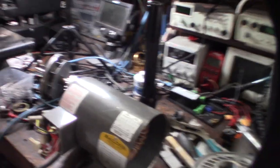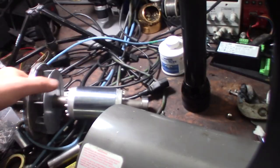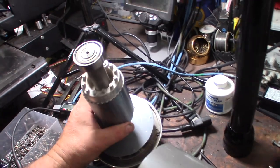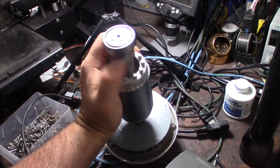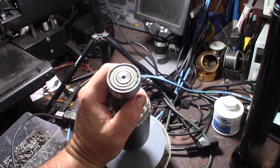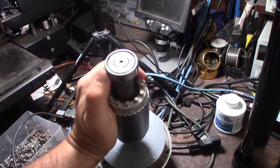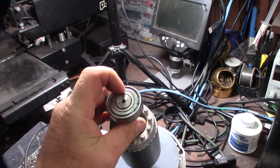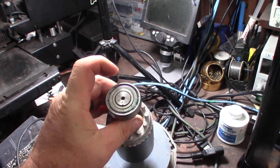The current bearings on here are metal steel bearings - these are actually better for high speed operation. But bearings with black rubber seals actually seal better than the metal face ones. What I'm talking about is the little face/shield on the bearing - sometimes you see bearings with a metal face and some with plastic.